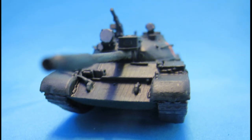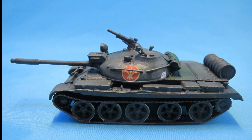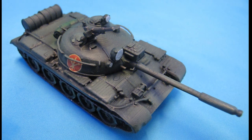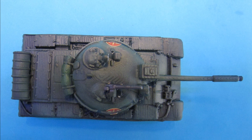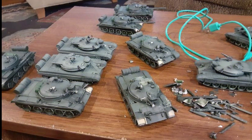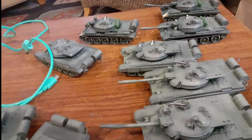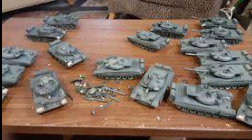I also learned about orientation of the model to get fewer layer marks, and not cleaning all the resin off the model — or reapplying some at the top where the curves are — for a much smoother finish. All the detail was practically spot on and I am very happy with how this turned out, as was the client. These were double-boxed and individually wrapped using my experience in shipping models, going as far as air flights travelling halfway across the world to the United States.